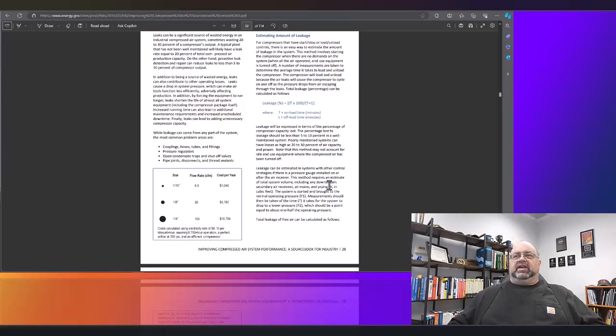Part of the thing that can cause these overloads, in addition to improper settings of the compressors, and unfortunately some of the comments we've had from some of the technicians associated with the compressors is, well, they set them to these points because they feel the equipment can handle it. I'm sorry, motors are designed to run to a maximum. The ones we have seen coming out have obvious overload conditions. At another plant we were seeing something similar, 160 to 210% load. That means all the safeties were set aside.